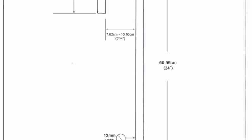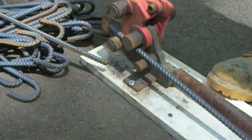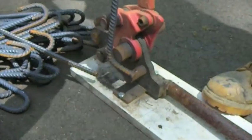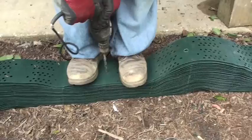Here is a diagram on what we call for in a J-hook. The tool required to make your own J-hook is a rebar cutter and bender. This is a simple way to make J-hooks on site so you know you have enough for the job.